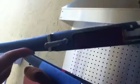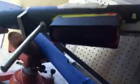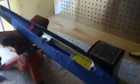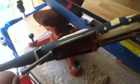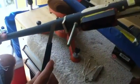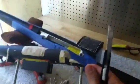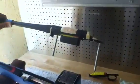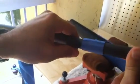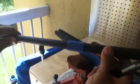well that I have put in there with modeling clay, secured it, filled in all the holes. As you can see, all the little holes for the trigger assembly, the ejection port. I've taped up the recoil lug with 2 layers of masking tape. That's pretty much the preparation for the action. I've put a block of tape up here in the front, and that's so the barrel will be free floated when the whole thing is done.